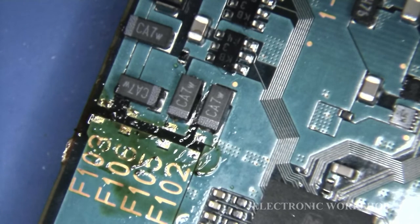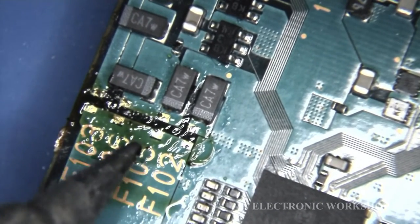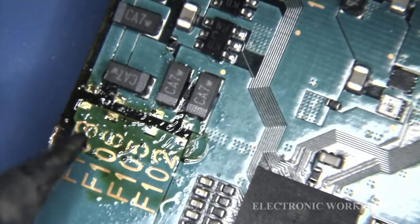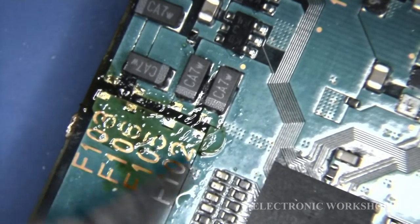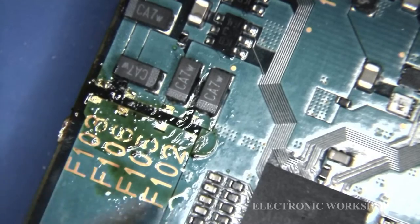Okay, what I did to remove them was I just flooded them with solder and I used the bigger soldering iron, and that removed them no problem. The miniature soldering iron wasn't up to the task. This here was a lot better. I'm going to replace all four of them